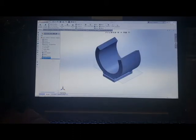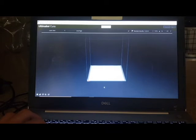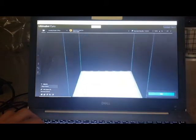And we are going to then leave that and go into Cura. Now Cura is what they call a slicer. And this thing has basically information and details on my printer. You can see here I have a Creality Ender 5 Plus. I'm using a 0.4 millimeter nozzle, and I would be probably making this out of PLA. So if I take that information, I open up my file, and I go into my zapper clip. You can see here it shows up on the build plate.